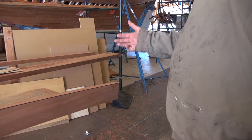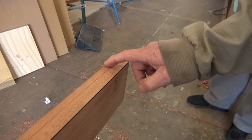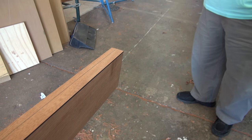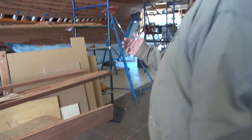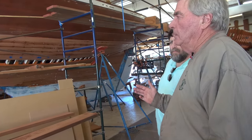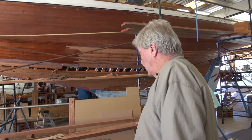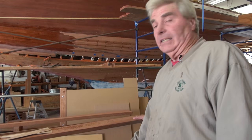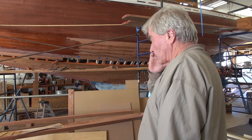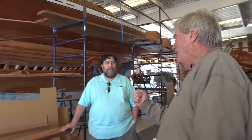The cotton is driven in not too hard, where it almost bottoms out, so the cotton ends up being shaped like a wedge but comes up about a quarter inch or so shy of the outside of the plank. And that's where your seam compound goes. Below the waterline, we'll use tar. So when the plank begins to swell, you want the inside edge of the plank to swell up tight against the plank above and below it. The cotton cuts into the plank — of course it keeps water out, but what really keeps the water out is these planks swelling together. The paint on the plank crushes into that under tremendous pressure and it gets watertight. So when you're fitting bottom planks, you want them to fit nice, but not banging them in there.